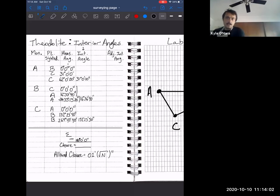All right. Kenny is getting 180 degrees, 0 minutes and 40 seconds. Do we have anyone else that got the same? Good. Yeah, this one's nice. When I took the angles for this one, I took them to the nearest 20 because that is what the machine can reasonably read to, so it kind of makes the math a little easier there. So 180 degrees, 0 minutes, 40 seconds.